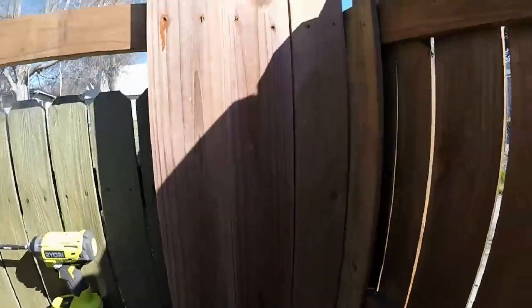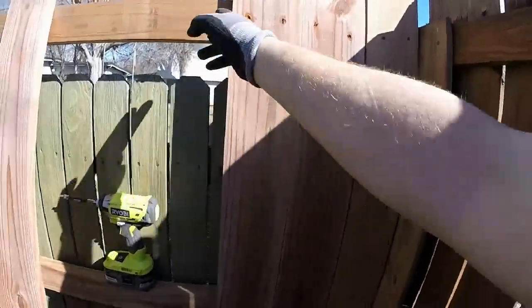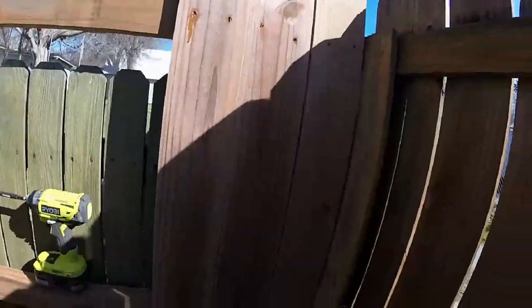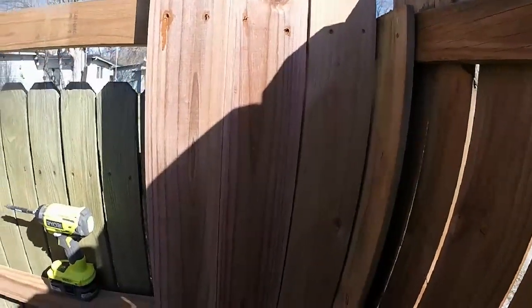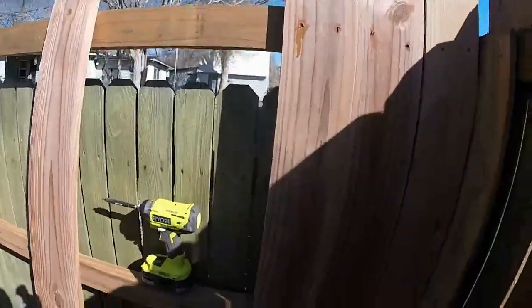and develop my spacing. If you already have dry boards, you might want to put one screw in here and create a one screw length spacing in between your boards to give you a little bit of a space like that if you're dealing with dry boards. I'm dealing with wet, so tight spacing, they'll shrink up, give me more space.